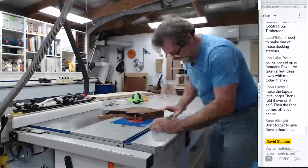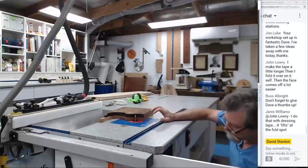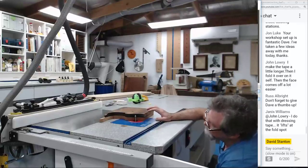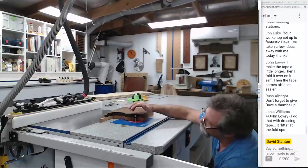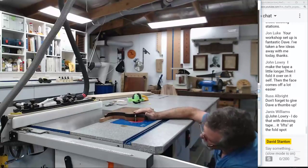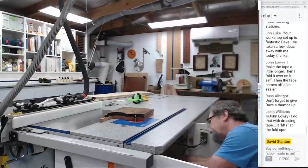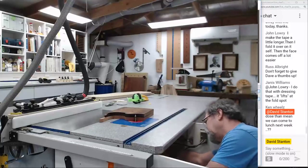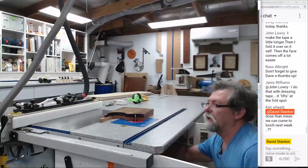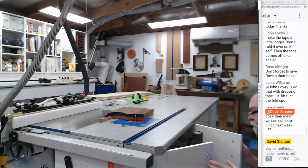So now I set the cutter so that the bearings, both the bearings, are going to be on the top there. So I don't have a bearing coming down onto here at all. It's all got to be up there, and I can come up slightly past. That's fine. Now I lock it in position with my spanner. Like so. And turn the machine back on itself without turning the auxiliary switch on.